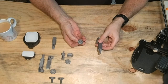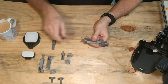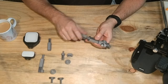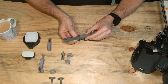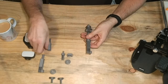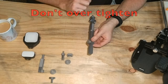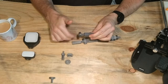So next step, I'll use another one of these round nuts and thread it onto the arm. Now I'll use one of the other pieces that you want to thread onto the extension of the articulated arm. As you see here, this can be twisted into position and then locked into position with the locking nut to wherever you want it. Now I'll install the next part of it — another thumb wheel or thumb nut. Lock that lightly, then install another one of the nuts on the last part of the articulated arm.